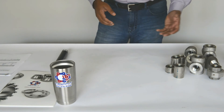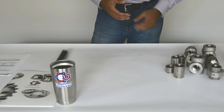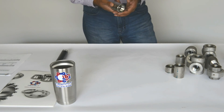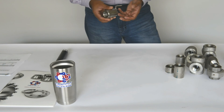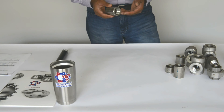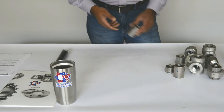They are available in forged carbon steel — A105, A105N — as well as stainless steel and nickel alloys. A lot of people ask the difference between a forged threaded fitting and a malleable iron fitting. A malleable iron fitting is used for light industrial plumbing applications, whereas these threaded fittings have a high pressure rating and are made from forged steel. One big difference is that malleable iron fittings are not suitable for welding, whereas you can weld threaded fittings if your application requires it.